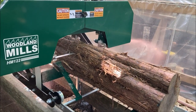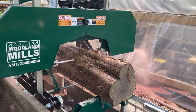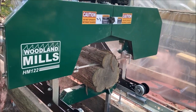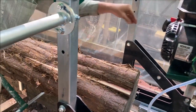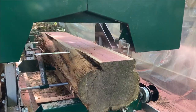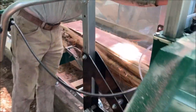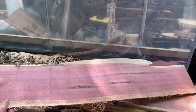There is a video of me using a chainsaw mill on this, and I'll tell you what — I don't think I'll ever use a chainsaw mill again. If I do, it'll only be because I need to bring the saw to the wood. This thing is so much easier to operate. It is a little bit faster in the cut, not a whole lot, but definitely faster. What's really faster is the setup between cuts — you can just slide this back, crank down the handle on the graduated scale, and push it through again. Literally two minutes back into the wood. It takes much less time to get into your second cut, and there's a whole lot less fussing.